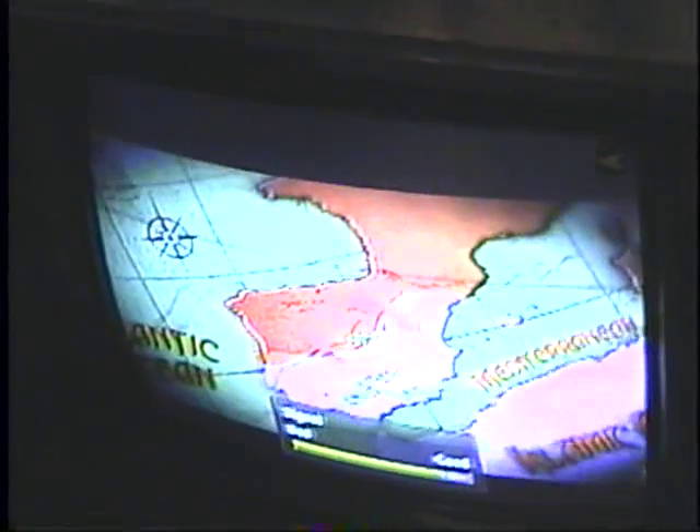As you can see, it's got the typically good Zenith chroma color picture. I had to adjust some controls on the chroma module to get the color to come in. I'll need to refine it a little bit more because sometimes it loses color sync. I've got a whole other junk Zenith chassis though that I can use to replace the module if I need to.